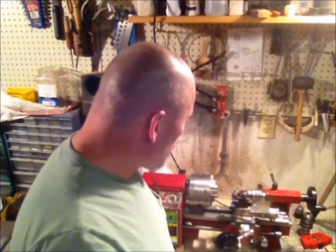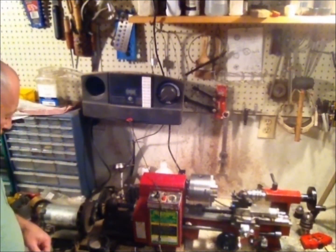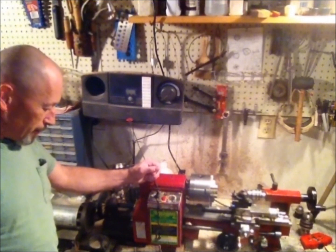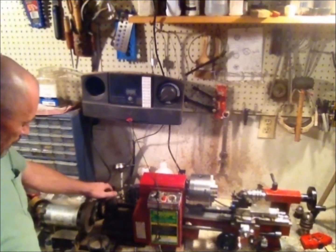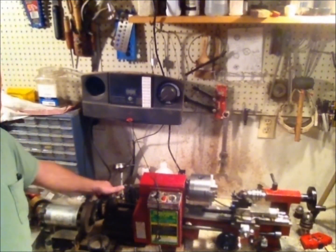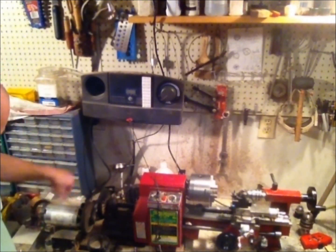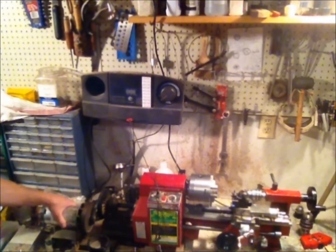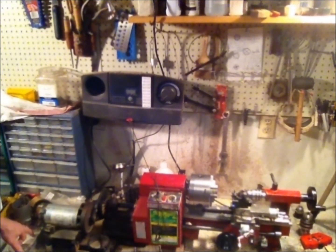And me and Scott were talking about my lathe setup the other day, and I wanted to real quick show my crazy lathe setup. My lathe is powered, the original speed controller went out, and the lathe was always underpowered anyway. So I got to researching online, see what other people were doing, and a lot of people were using treadmill motors to power their mills and lathes. So that's what I did. This right here is actually a treadmill motor,